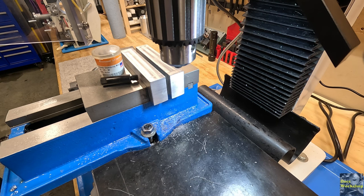But the official definition of this is, an outside chamfering mill is designed to economically chamfer a large variety of diameters on tubing, pipes, and rods. The chatterless teeth produce a heavy chamfer. One size can accommodate many size parts. The outside chamfering mill is available in the 60 and 90 degree angles. May be reground many times. So, I thought, let's see this thing in action. It's a pretty cool tool.